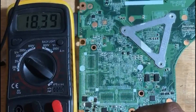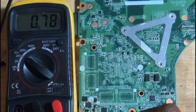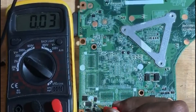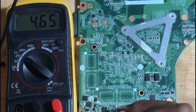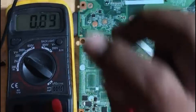Let's check the results again. VIN is 18.5 volts. Voltage at battery port is 0.8 volts. Voltage at pin 3 of PQ5 is 17.7 volts. This is the normal condition. And now it can be confirmed that this motherboard will work normally.